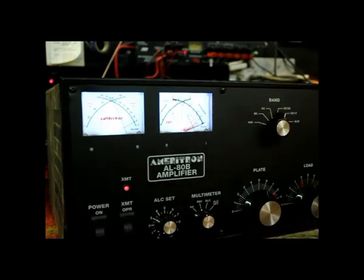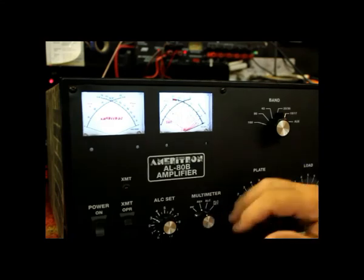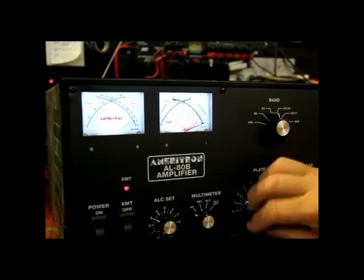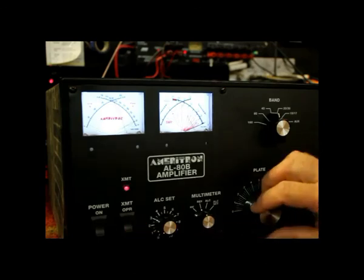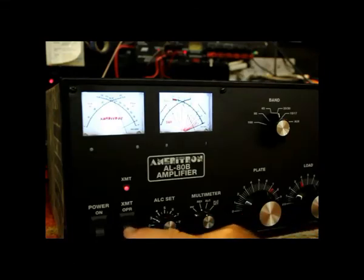Without talking, I'm going to go back to 40 meters. I put the amp on standby, flip the exciter back to 40 meters. I'm going to show you how quick this is — I'm going to hose up all the controls here so they're just in random position. I'm putting the amp on 40. I turned the amp on. That tells me it kicked out — tells me I need more load control. I put more load control in. There we go — all tuned. Tuned perfect on 40 meters that fast and that safely.